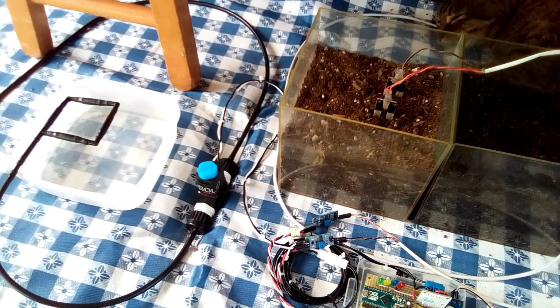The controller will then continue to monitor the state of the sensors until both report that the moisture content of the soil surrounding them is sufficiently dry to initiate a new irrigation cycle. During an uninterrupted irrigation cycle, once the dry period countdown expires, the red LED will go out and irrigation will begin. This state is represented by the blue LED.